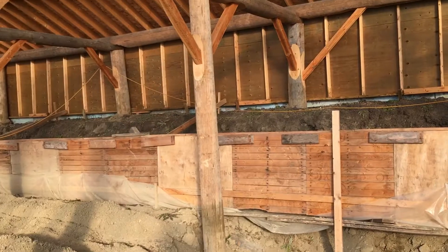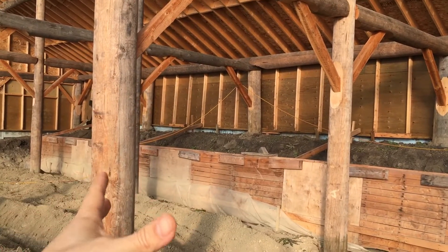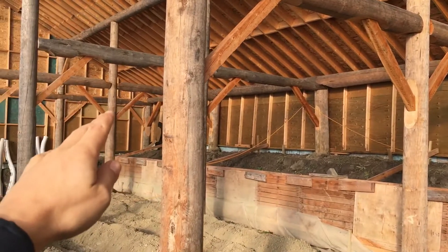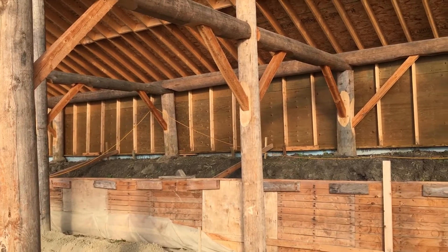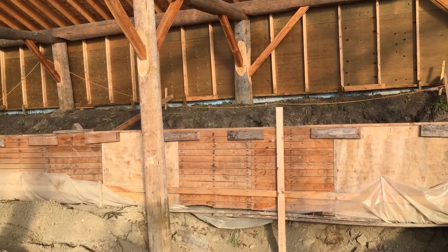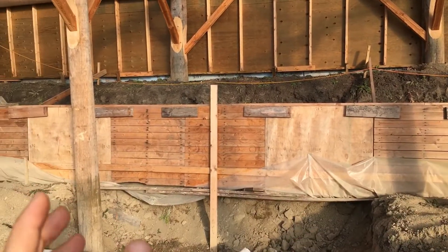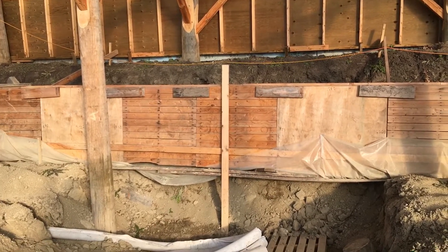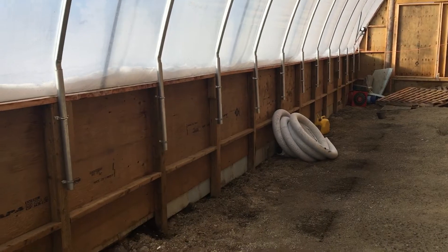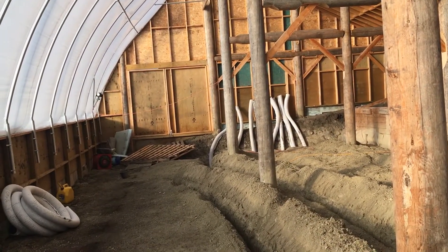After this is complete with the manifolds, I'll be installing two really big black cylinders — about 10 feet tall and 5 feet wide, roughly 2,000 gallons each — for water storage. The roof has a rainwater collection system; the pipe will come in here and fill these. Being black they'll have a large thermal mass. In addition, I've got about 40 steel black barrels lined all the way along the back. There'll be two rocket mass heaters — one closer to each post — with cob benches extending out each way for additional thermal mass retention and redundant, synergistic heat storage. The front will have raised beds staggered down, and the back will similarly be staggered up.